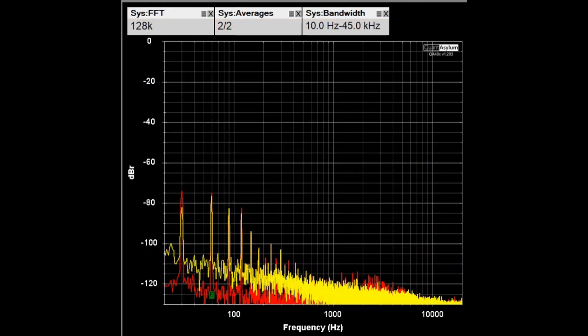For all measurements I used the auxiliary inputs of both HF-12s. Here I've got both auxiliary inputs terminated into shorts and we're just looking at the noise of the system — basically power supply related noise. It's really not too bad compared to some other tube amps I've tested; we're better than 75 dB. I'm guessing I'll hear this when I hook it up to the La Scala speakers for listening, but it's really not overly bad. The volume controls are set for about 23 dB of gain and both HF-12s are connected to 8 ohm loads.